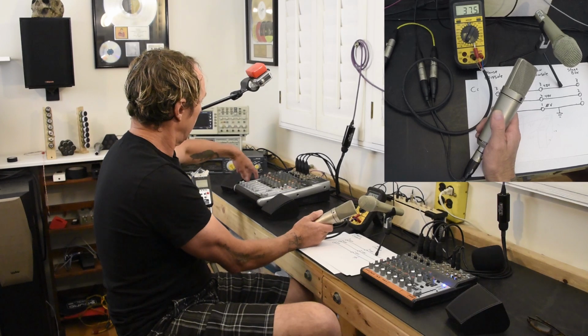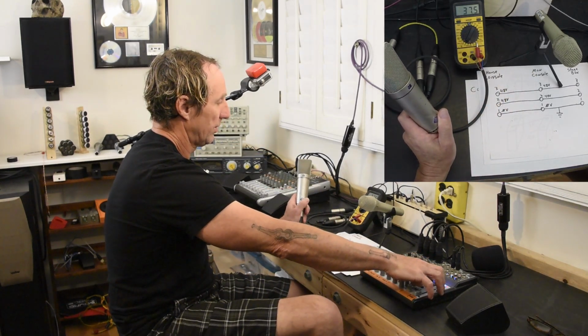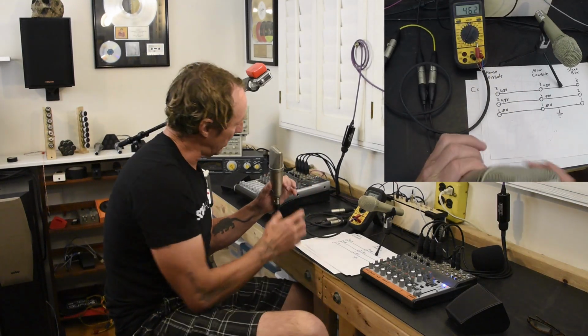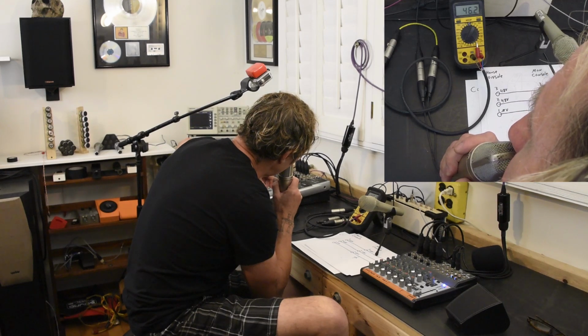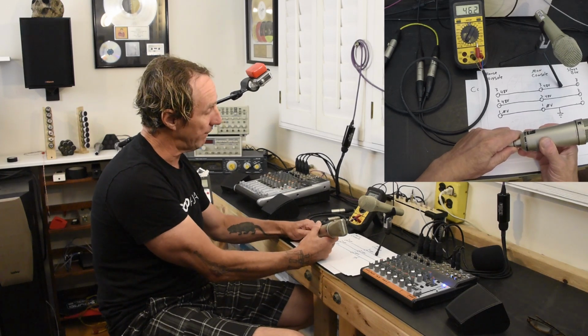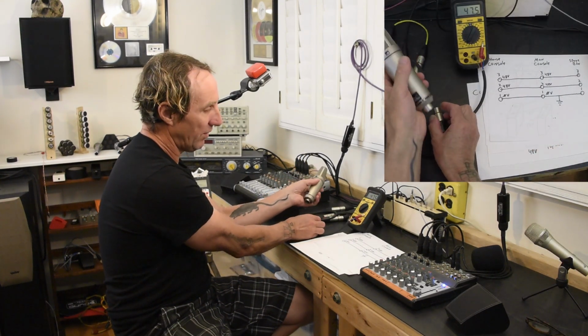All right. What happens if we turn phantom power on both consoles? It's climbing. And boom, we got 46 volts. And let's see what it sounds like. 2, 2, 2, 2, and we are all good. What happens if we unplug the mic with the two phantom powers? We go to 48 volts.